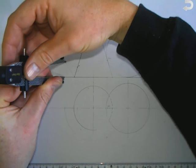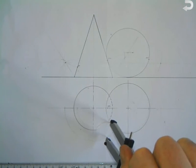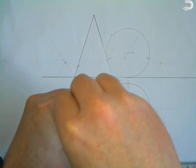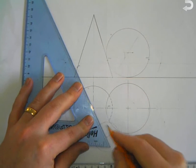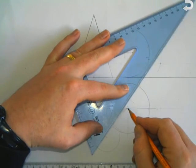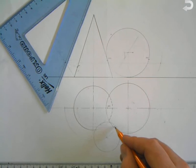We set it off our drawing that we've already measured up 20, place it in here, and then this is important — which lines are going to be heavy and which are going to be dotted. Obviously the sphere is going to block some of the cone, and because it's a smaller sphere it would fit underneath the larger sphere. That's our position in plan. The final thing in plan is to find our points of contact — we go from centre point to centre point, mark off where we've brought down the centre point from elevation, and mark our point of contact.